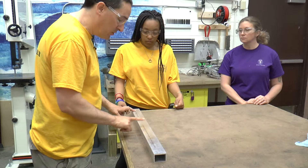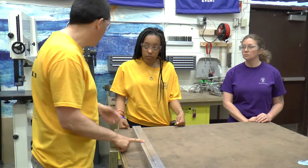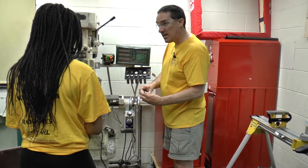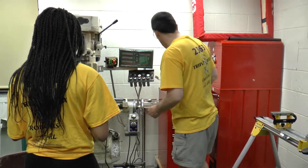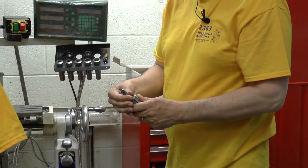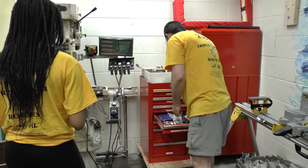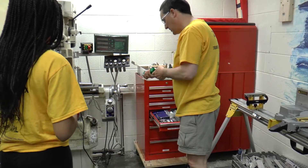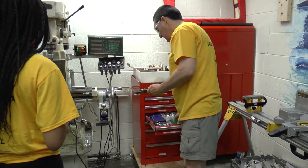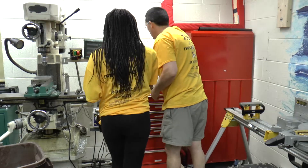When we do this on the milling machine, we're going to put the bearing diameter holes in and we can do that with a certain set of tools. This is our half inch collet — you can see it says half inch on the end of it, and that's the one we're going to install. First we use the half inch diameter center drill to locate the hole, then we use our big bearing drill bit to drill the bearing hole. This has a half inch shank on it, so it will go in the same collet.